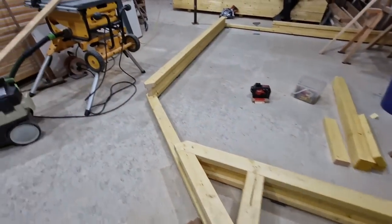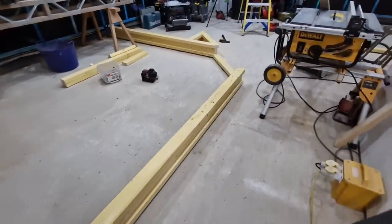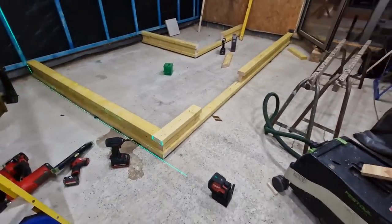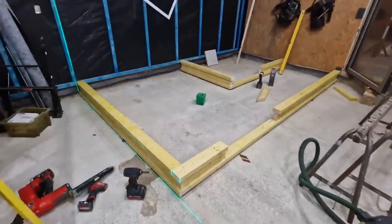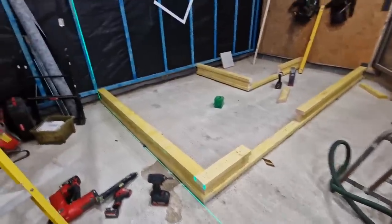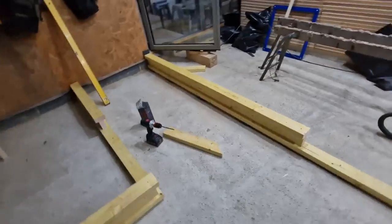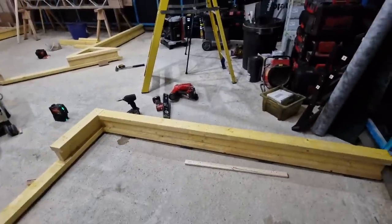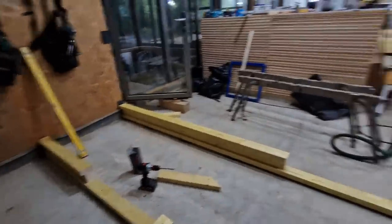We've got all of the sole plates in. We've got our I-beam section in, which basically gets our proper sole plate up to the height it needs to be, because we've got insulation going all over this slab, underfloor heating pipes, etc. We want the sole plate to be at the right level to catch the bottom of the plasterboard — this is a really nice way of doing it. Now, this timber is really, really dry. They aim to get a moisture content of around 15%, which is quite low for softwoods, so that means there's no shrinkage. If you were making this section out of really wet timber from the timber merchant, the chances are it could shrink a little in height. So there we have it — that's the sole plates done.